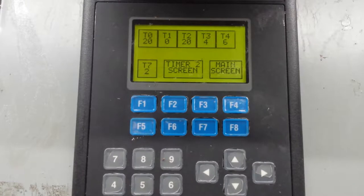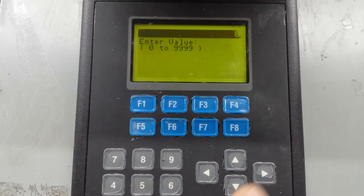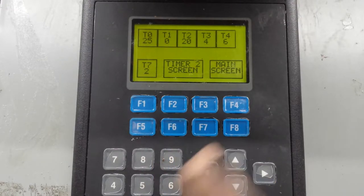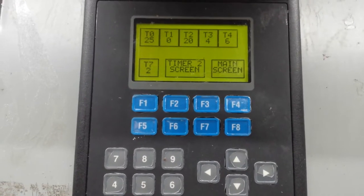Now if you want to change T2 or T0, which is the heating time, for example, what you do - you go to F1. You press F1 and prompt this. Then you just enter your number. Let's say you want to enter 24 seconds. You press 2 and 5 - that's 25 seconds. Then you press enter, and that will give you 25 seconds. That's your heating time. T1, if you want to put delay at the bottom platen, you do the same thing. You go to F2, F3, F4, and then refer to the book - they will tell you which is which.